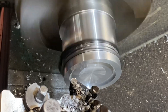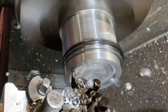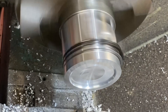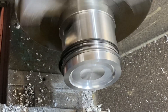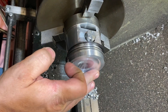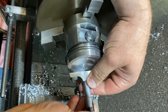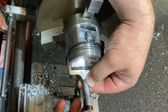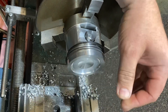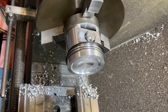This takes us up to the measuring point. Just make sure there's no burr on that edge there to keep the depth mic from reading properly. And we got 131, so again we're going to take 10 thou off to make that 141 — spot on.